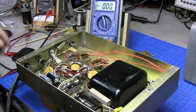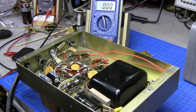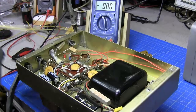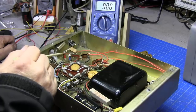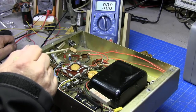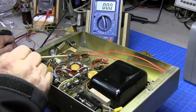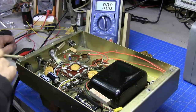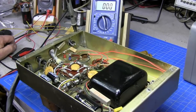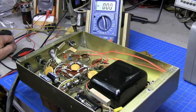Okay, look at this. Like I said, that's not on the schematic. High voltage comes around, comes to one side of the 5 ohm resistor. Goes on the other side, it picks the red wire up, goes back out to pin 1 to connect to the radio.